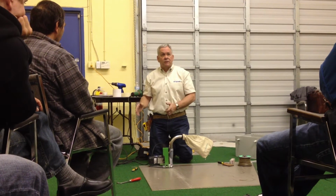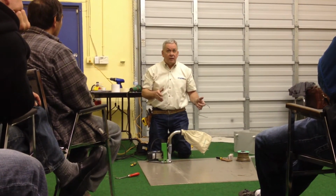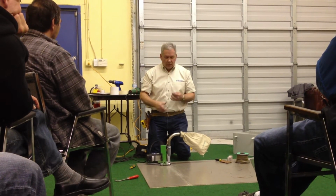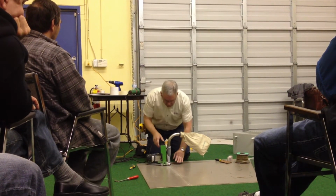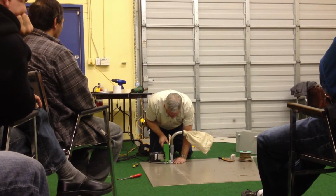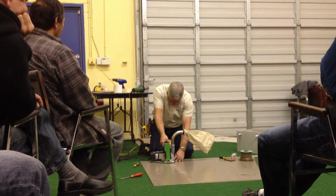Because everybody uses different fillers, everybody uses a different content of fillers, you know, percentage and stuff like that, and this all makes a difference in heat welding. So I always do a piece of scrap. I'm going to assume that because this has got linoleum dust all over it, this is already set for linoleum.